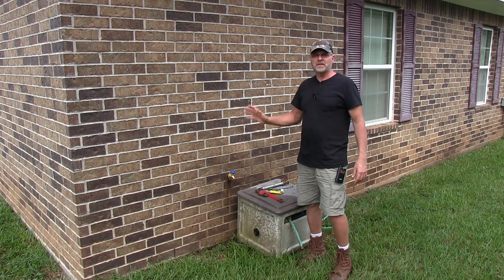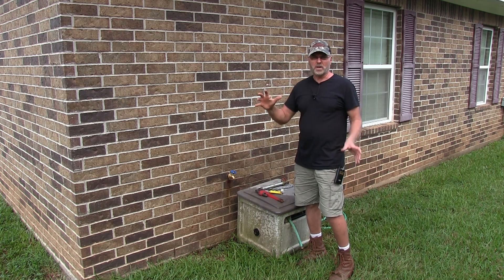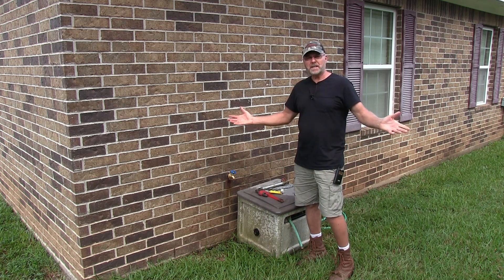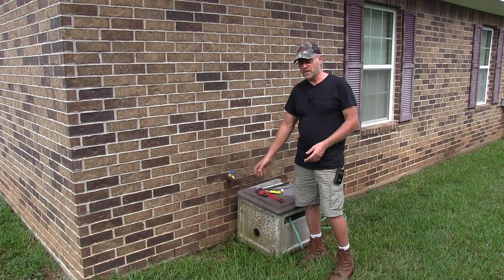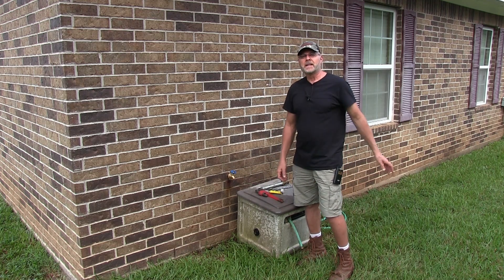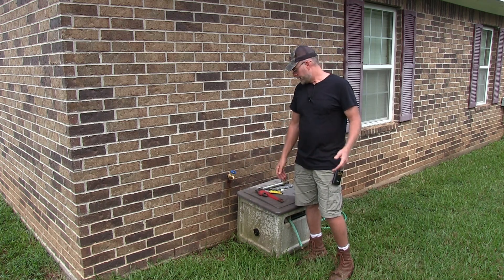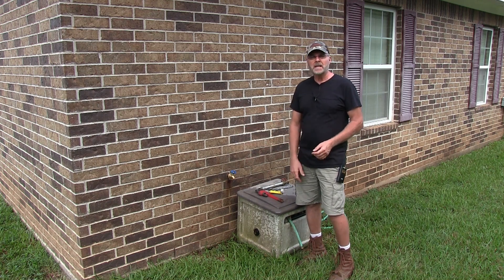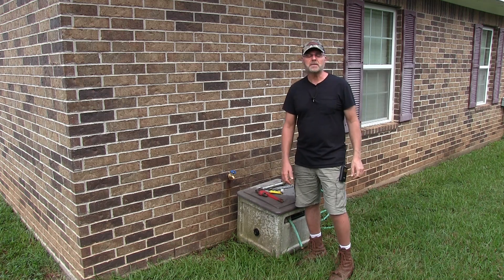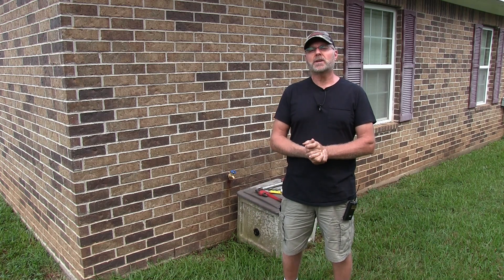Water is back on. Now I just need to go inside and check for any leaks. Like I said, I'm going to let the two-by-fours and studs in there dry up for at least another week — I don't want to close it up with moisture still in there. Normally this wouldn't be this difficult; you'd just unscrew the silcock and put a new one in. But since mine was leaking inside and the person who installed it used black pipe, it leaked inside the wall. I hope you learned something from this. Please like and subscribe, hit the notification bell, and I'll see you in the next video.